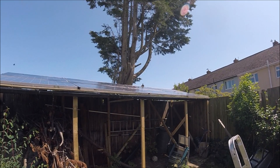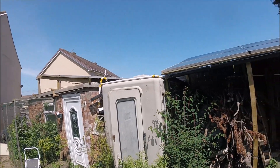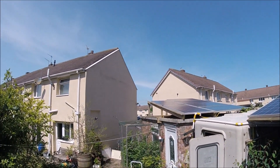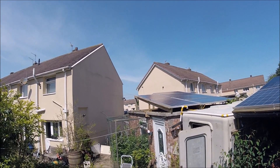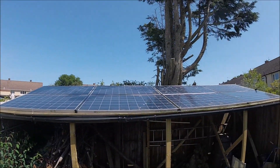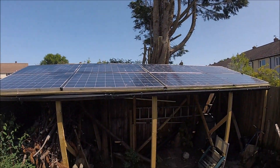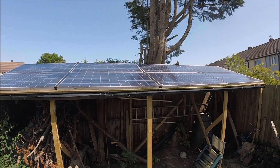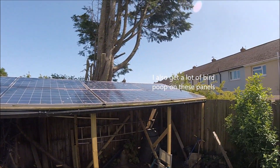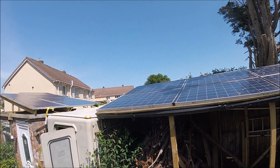I'm thinking of getting them all mounted up onto the roof of my house instead. It's quite a nice neat solar panel system and because I do have a south-facing garden, it gets sun pretty much all day. It's just because I've got a really tall tree neighbouring against my property that casts a shadow in the early morning until midday — that's why I decided to go with a two-string setup with a dual input MPPT controller mounted inside the garage.